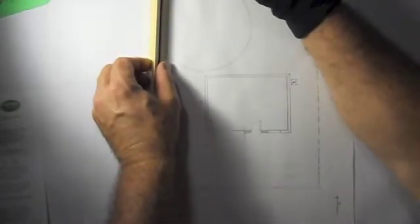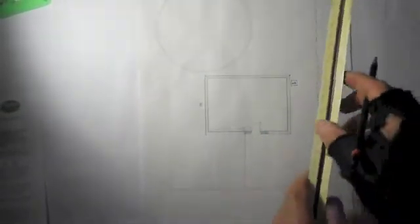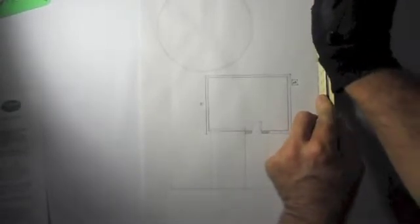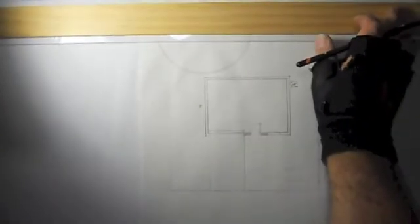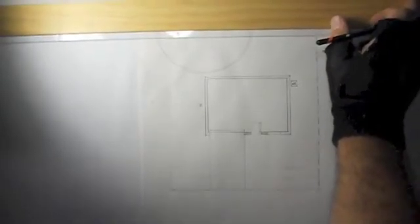So let's go measure that. Put the 0 on the line. 1, 2. Do that over here also. We can do it fairly easily. We'll just start with 80 and go to 78. And now we know that we have a fence there 2 feet away. Now they are 8 foot apart posts, and we use an X for the posts. So I am going to just right now draw a thin line across that and then come back with the X's on there.